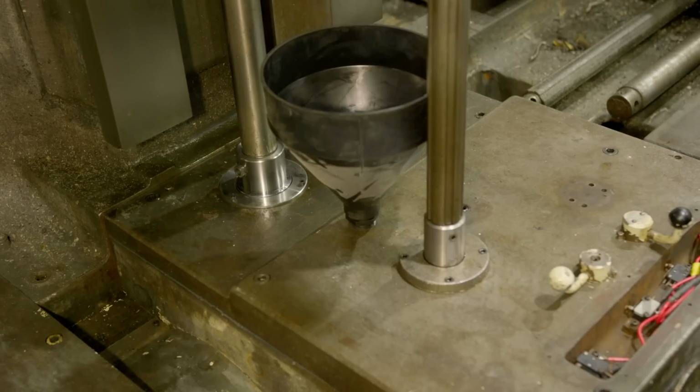In this case, it's always better to have clean oil that's slightly off on weight than dirty oil of the right weight. Everything is going to be nice and clean in here. We're going to run all these gearboxes once, and then I'm going to refresh the fluid. So I'm not too worried about it on the first fill. We'll probably put like 10 hours on the machine and then drain everything. So let's fill this guy up.